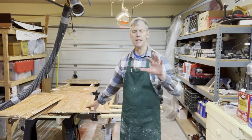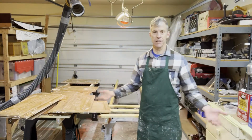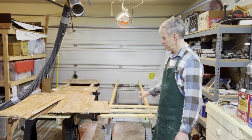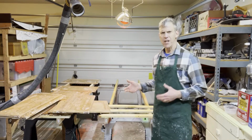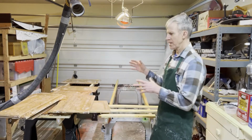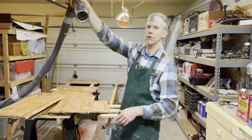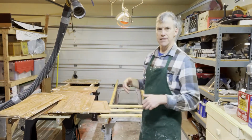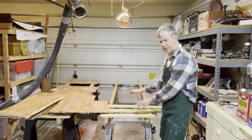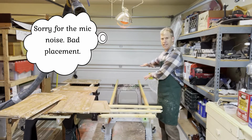And I wanted to go over my system. So when I first started, I had what I thought was an efficient system. I had these 4 sawhorses with the 2x3s on them, and what I found was it was easier to have a workstation. So for sanding, I have my vacuum cleaner set up over here with the hose dangling, so it suspends, and it's a lot easier to move around that way. And I found it a lot easier just to sand in this one location. So have a stack that needs to be sanded, and then have a stack that's done.